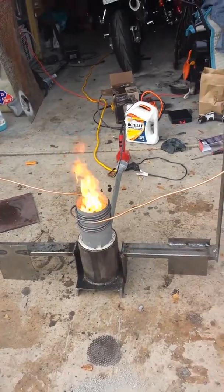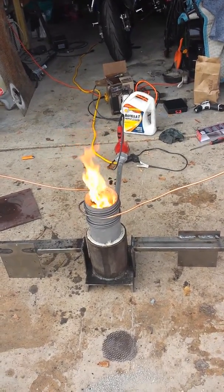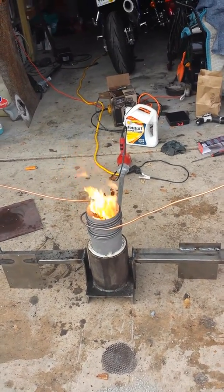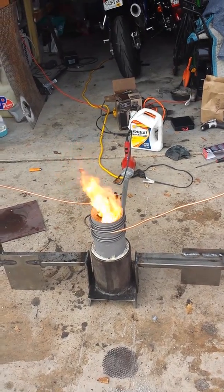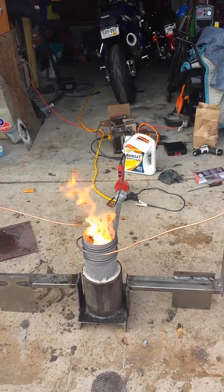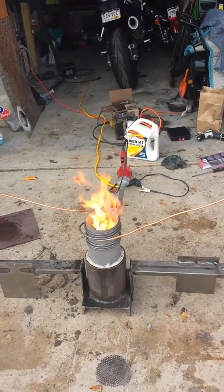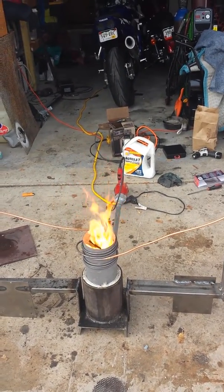What I did here is I made a Turk burner. There's lots of plans out there on the internet. What I did to modify mine is to feed the glycerin into it and preheat it, because it atomizes at about 400 degrees. It needs to get pretty hot so it burns with a clean combustion. As you can see here, there's a little smoke but not bad.